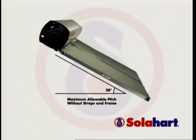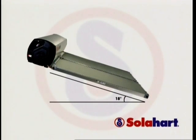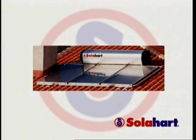If it is necessary to face the solar hot water heater 45 degrees to either the east or the west, a lower pitch installation will give better performance. In such cases, the addition of a third panel to the system may be more aesthetically, economically and thermally beneficial than mounting the heater on roof brackets to face the equator.